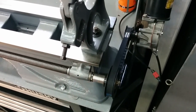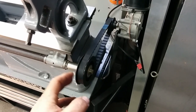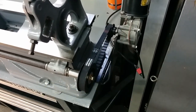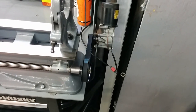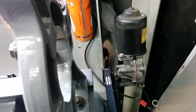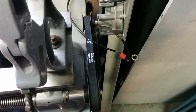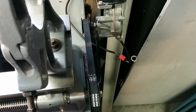I made this little extension for the lead screw on the lathe and just happened to have these pulleys. This is an L-pitch timing belt pulley — this one is 20 tooth and that's a 10 tooth. You could go one-to-one if you wanted to; that's just what I had, and I figured I'd try it first before buying something else. It seems to be working really well. It's pretty much infinite as far as speeding it up or slowing it down. This is about 15 on that scale, and you can see it's just creeping — and believe it or not, it's got a fair amount of torque even that slow.